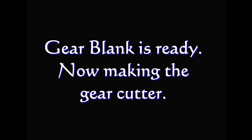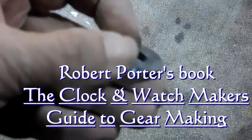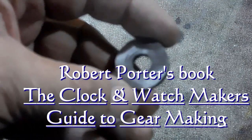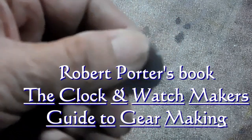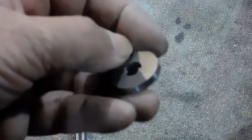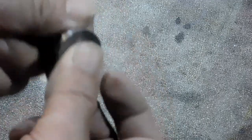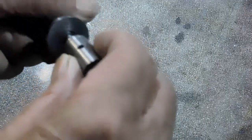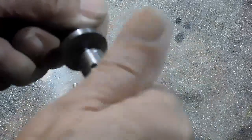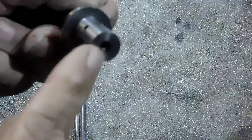Now we're going to make a gear cutter — this is all done according to Robert Porter's book. There's the gear blank I made out of one-inch water-hardening steel: faced and surface-ground down to the size I need to make this cutter for the great wheel. It fits on an arbor I made just for gear cutting, and when tightened up it runs perfectly between centers.